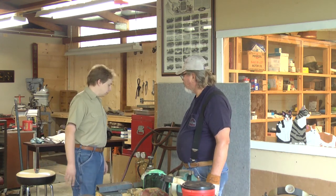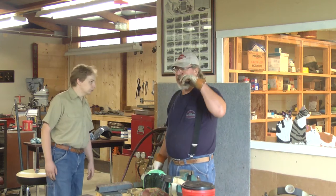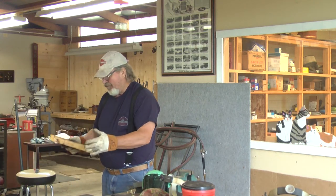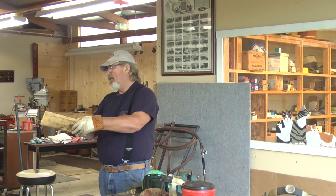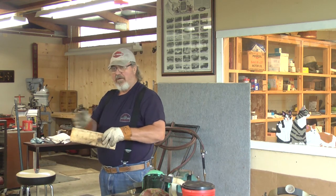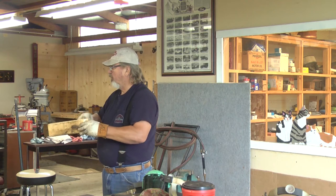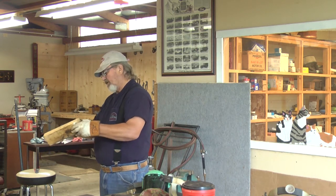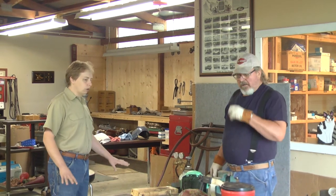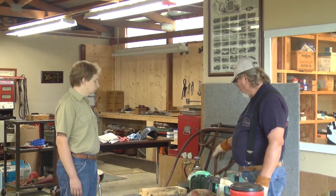When I get ready to take these in for exchange, I'll turn them off, unhook the gauge, and put a cap on. Any special precautions when transporting? On my pickup I took a piece of two-by-eight, cut notches so the tank sits right in there, and got two bungees — so they don't roll around. Before you ever move cylinders, they should have a cap. When you get a new assembly it might come with a cap, and you might have to use an adapter. If you buy a new set of torches, it might have a different end or come with an adapter.